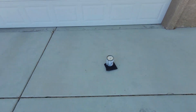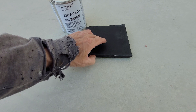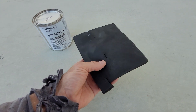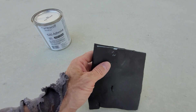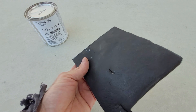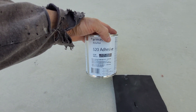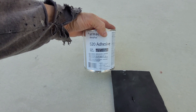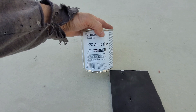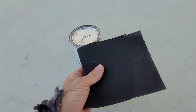This is what the insulation looks like — it's half-inch Armaflex. It's more like a rubbery foam, pretty dense but lightweight. I only use the approved adhesive because a lot of adhesives will just melt rubber or any kind of insulation. This adhesive is designed specifically for Armaflex.